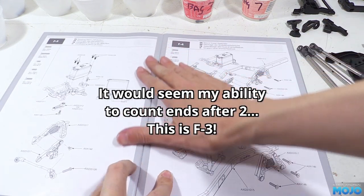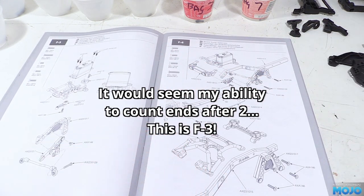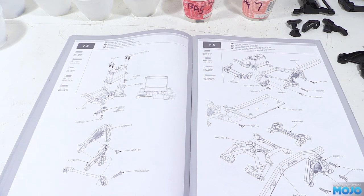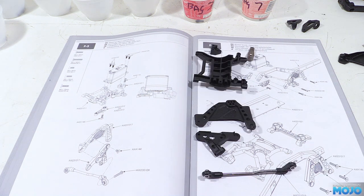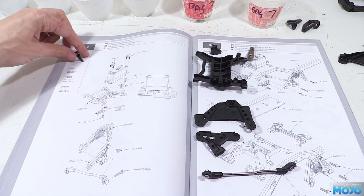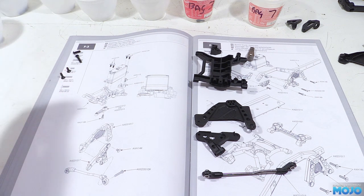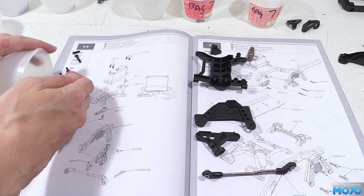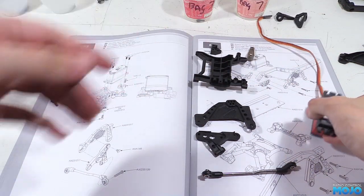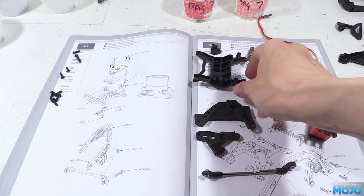F4, the steering servo and panhard mount — this one's going to be a fun one. Something that should be really simple but is made rather difficult. I'm not sure whether it's a bit of an attempted vendor lock-in or just a bit of innocent limited testing, but it's a pain either way. We need the adjustable bit of the servo mount, the servo mount itself, the front left damper mount, the panhard bar. For screws there's an M3x10, an M3x14, an M3x8 countersunk, an M3x10 countersunk and four M3x10s with large thin heads. For the servo we're using a 25kg cheap servo — not the best but not the worst, and they do the job well enough. Plus they're pretty cheap.